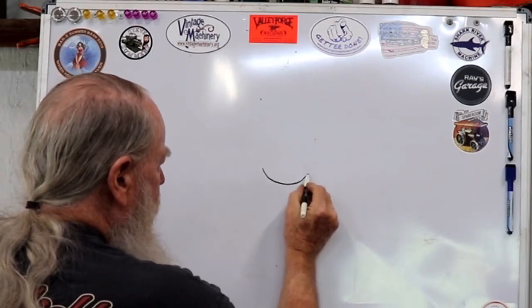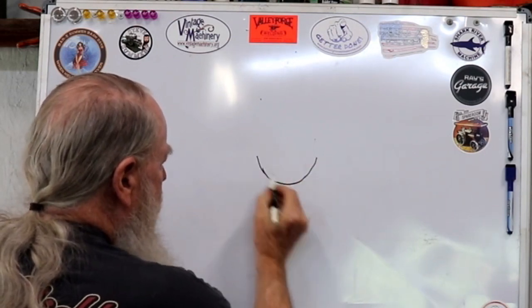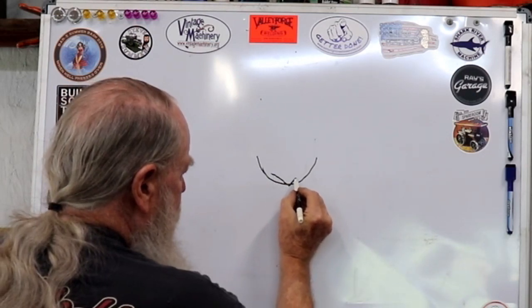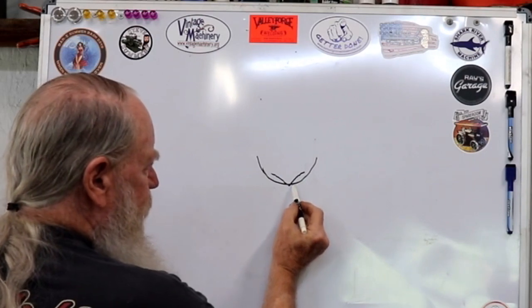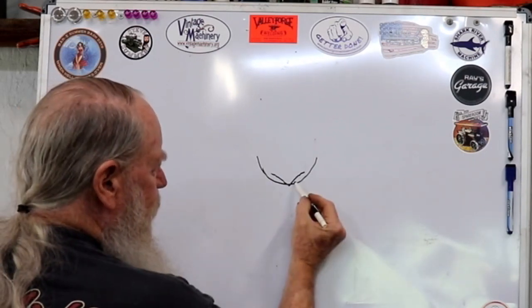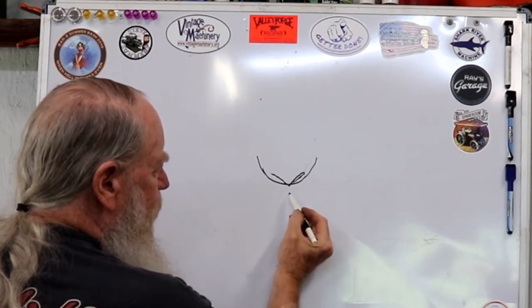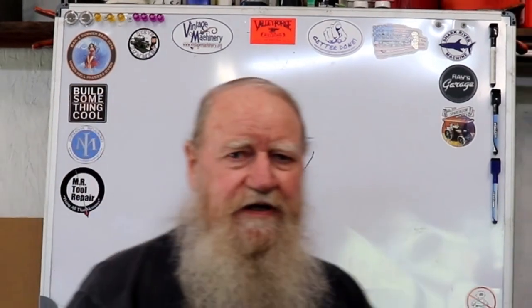On a round, if you decrease the angle where it starts coming through, you have a very small amount. Plus, it's supporting the drill for a longer period of time. Okay? So, just by stopping and resharpening the drill, I also decreased the rake a little bit so it didn't want to grab and pull itself through. So I hope that might be a little tip for you.